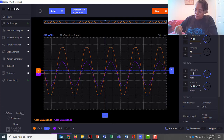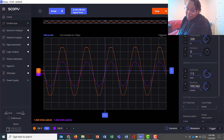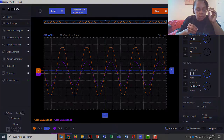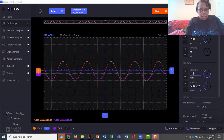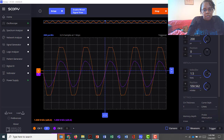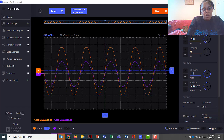Just to recap: one issue was that the breadboard bus does not go all the way across the breadboard — I had honestly never seen a breadboard like that before, but you live and you learn. The other thing was that my potentiometer — I did not have the wiper and one side of the potentiometer connected to ground. I'm now going to put the two diodes in parallel across the 4.7 kiloohm that goes to pin one. I now have the diodes in — you notice it looks a little cleaner, there's no saturation. Let's turn it up. It does still saturate, but it doesn't saturate quite as quickly.